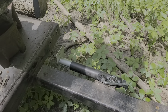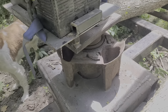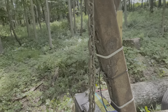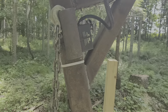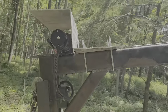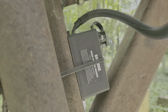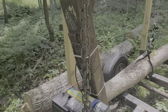Went to Harbor Freight and got a trailer jack. The crane is made from a semi wheel — that's the wheel — and there is the axle. I just welded my crane onto it, kind of took a guess at the angle to lean it back, made a little gusset for the boom. This boom is about seven feet. Got a small ATV winch on it — it's actually got a wireless remote, so that's the control box, and you can also put a wired remote in there. Just run it with a truck battery; that truck battery will run that winch all day.